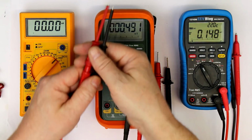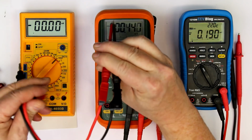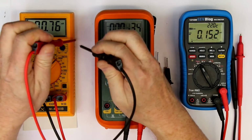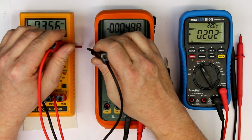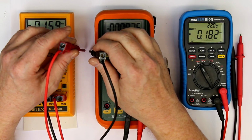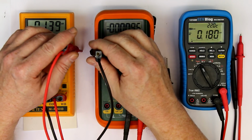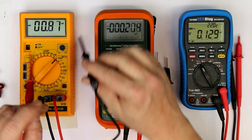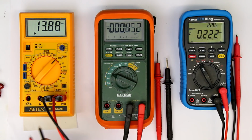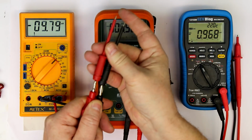nothing more important than having ultra sharp probe tips, so that you can poke through the oxide layer of your test points without applying any pressure. They will just by their sharp tips, even with the weight of their own, usually poke through the oxide layer, so that you can get a valid measurement result. And the combination of these not very cheap silicone cables and these attachable ultra sharp probe tips, that is just